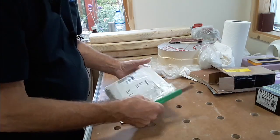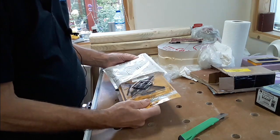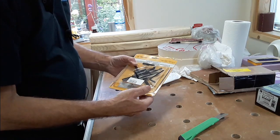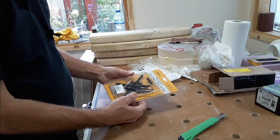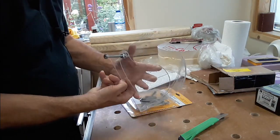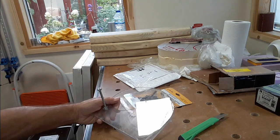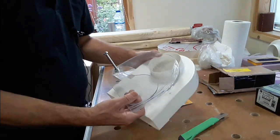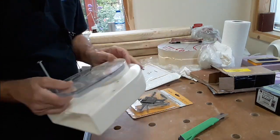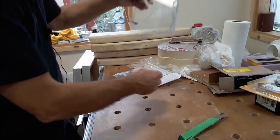And this arrived this morning — I don't know what this one is. Ah yes, this is a circle cutter I've ordered. It's one of these that drills a hole in the centre and then you've got two cutting bits that you can slide out to adjust. That's to cut the holes in the perspex blast gates that I'm just working on at the moment. They've got to have a hole cut in that part that's the equivalent of the outlet. These gates are going to fit inside that part there and I need a hole to match the hole on the extract. That will come up in a dust extraction video.